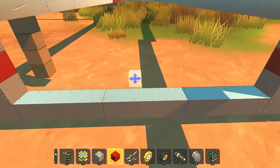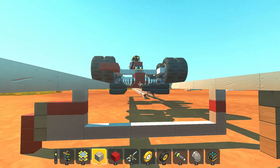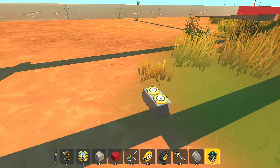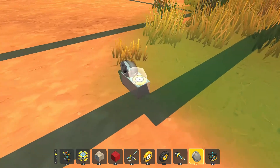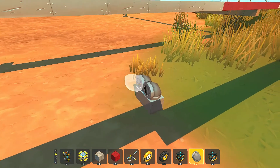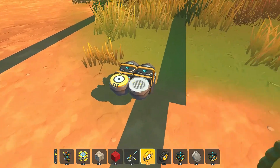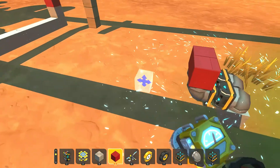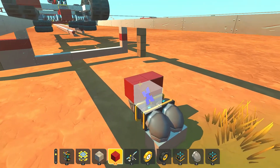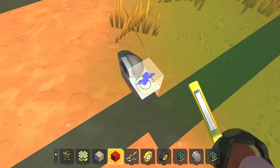The linkage to make the pivot area — where the centre line is, where the seat is, versus the bogies — I've actually built it with pistons as well. With a piston like this, a bearing like this, and the bearings on the top — that's what's up the top there, but with a narrow pipe. It's all cross-welded to make it work. The actual pistons are what's allowing the pivot to work because they've got a little bit of flex in them.